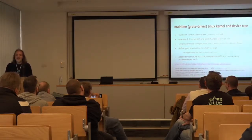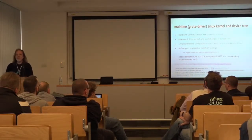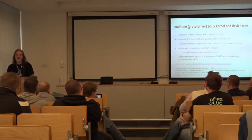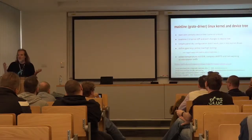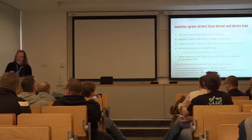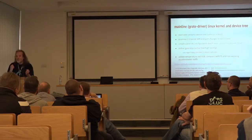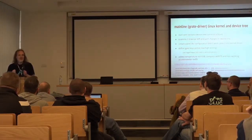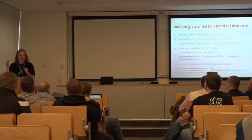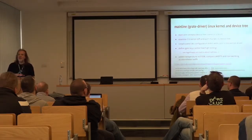Once I had U-Boot, the next step was to compile the kernel and make it work. As I mentioned, there is a great driver project which supports 2D and 3D acceleration on Tegra devices. I started with it because I wanted 2D, 3D, and video decoding. I started in the same way — I looked at the 2.6 kernel and tried to port the display. It should be possible to define the display in device tree itself, but for some reason that didn't work for me, so there were a few lines of diff in the kernel itself. All other things were basically device tree configuration.